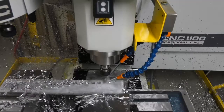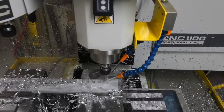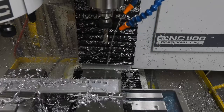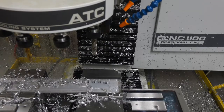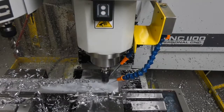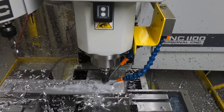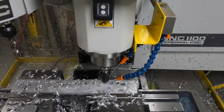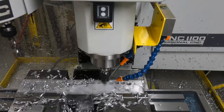It's a bit of a balance trying to keep the drill bit clean and also speed up the process. I could run it a whole lot faster, but the stringy chips would become a real mess. Here comes the tool change. This is a deep decorative countersink — these holes are mostly for lightening the part but also serve a decorative purpose, so this countersink is being done to make the edges look a little nicer. It's a seven-eighths diameter, six-flute countersink running at 800 RPM. I'm still getting a tiny bit of chatter and I may reduce the RPM a little bit more.